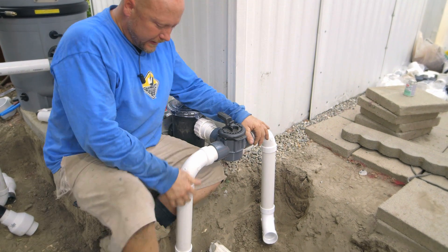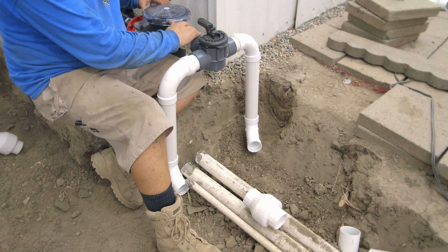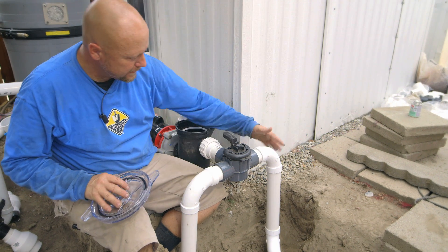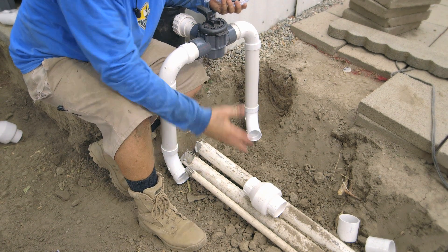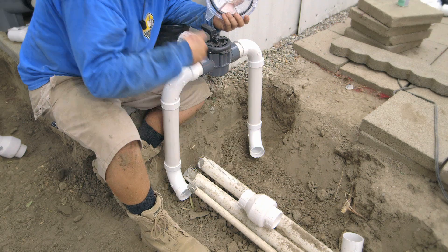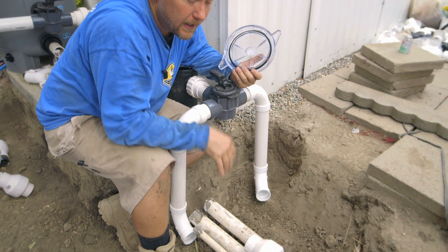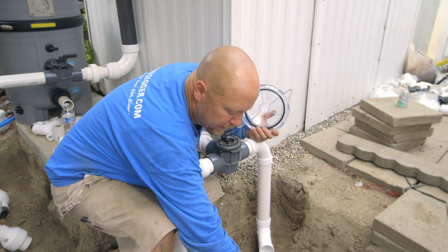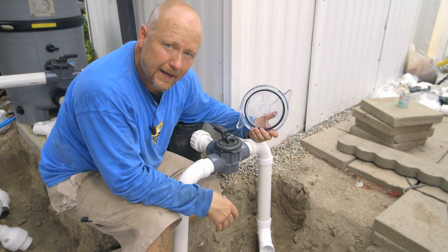I have my two pipes extended below grade. While I have everything opened up, I want to explain something about flooded suction and priming the lines. When I take the lid off the priming pot and add water to it, the water will travel through these pipes and go into these two pipes that lead to the pond. If I didn't have any one-way valves in there, the pond would just start to fill up with water. So I'm going to install a check valve in each one of these lines so the water gets stopped right here. These lines from the pond are below water level, so when we fill the pond completely, these lines will be flooded all the way back to the valve. The priming pot will let us flood the lines all the way to this side of the valve, so there won't be any air trapped inside.